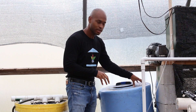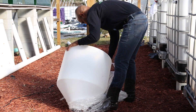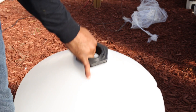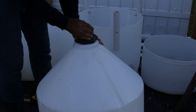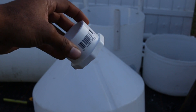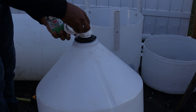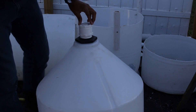What I used to build this is a very simple 35-gallon inductor tank. It has a conical bottom, and on the end of that conical bottom there's a 2-inch female threaded portion. All I did was take a male PVC coupling, thread it in there, and then from there I can reduce the piping to whatever size I wanted. In this instance I chose to reduce it down to a 1-inch pipe, so I put a reducer on the end of that 2-inch coupling and voilà — we have the drain size we want.